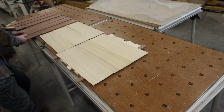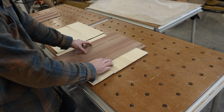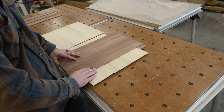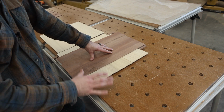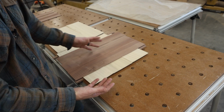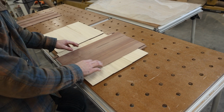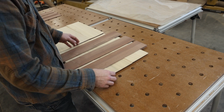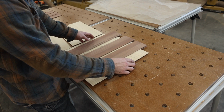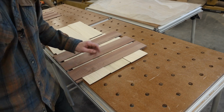And then for the last step, we're going to take a veneered panel of walnut and crossband that back to the original orientation that we want. And hopefully that sandwich comes out dead flat, perfect. It's all hardwood. It's a lot of work, but in the end, it's a superior result. So I'm going to show you how I take all of these pieces, glue them up in individual steps, put them in the vacuum bag, and really come up with a nice piece of plywood.